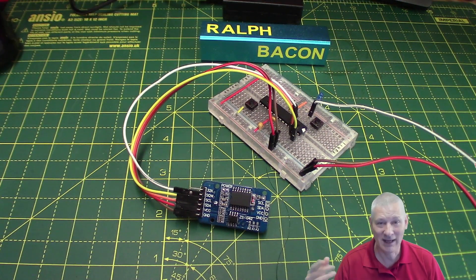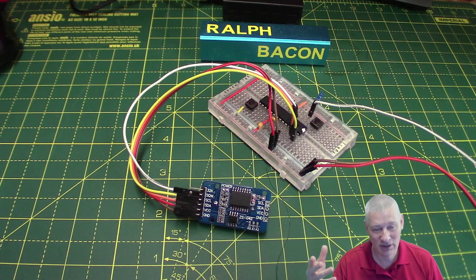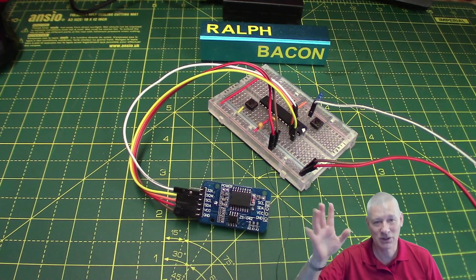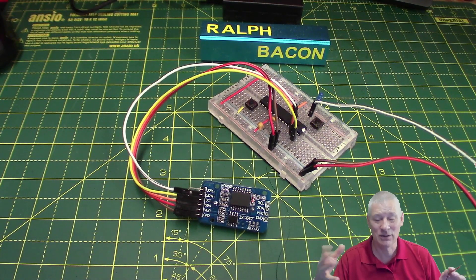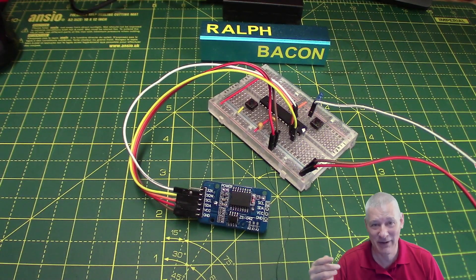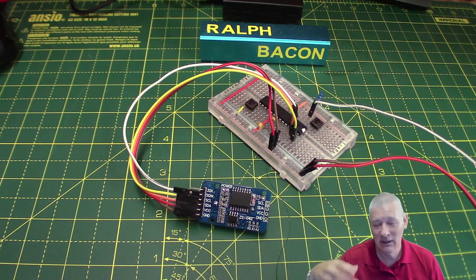You can make it wake up at most every eight seconds. That's what everybody does - you set the watchdog timer, eight seconds later it expires and goes into the interrupt. You wake up, reset it, check should I be awake? No, only eight seconds have passed, not 24 hours. Go back to sleep. You do this 10,800 times in a 24-hour period.